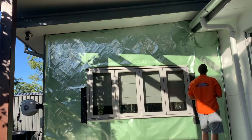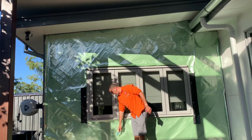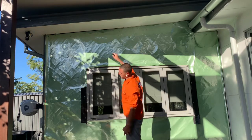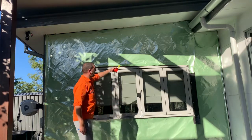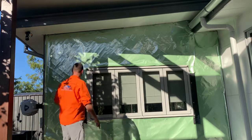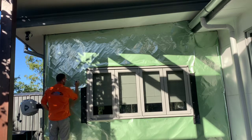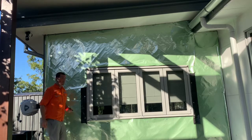Then we're going to have the one that comes all the way from this side to the other side. Now, we worked out before we need 4300 for the toe, but that's flat without any pitch. So I'm going to add an extra 200mm. I could get up there and measure up there, but really, I'm pretty lazy, so I really don't want to do that. So I'm going to order the top flashing that runs all the way along there at 4.5 metres. One at 4,500. You can write 4.5, that's fine. They'll still make it at 4,500.